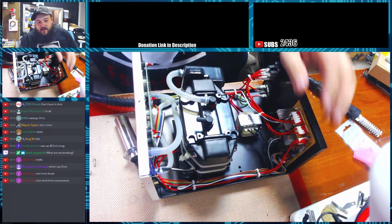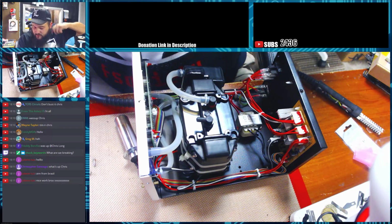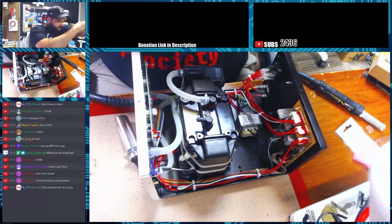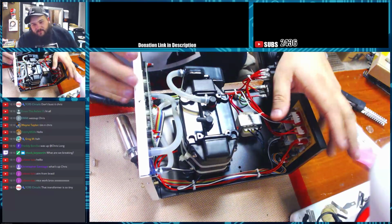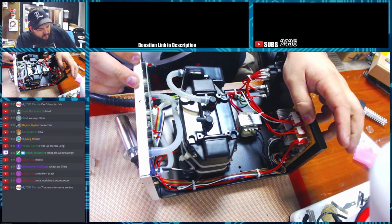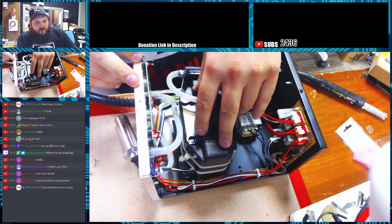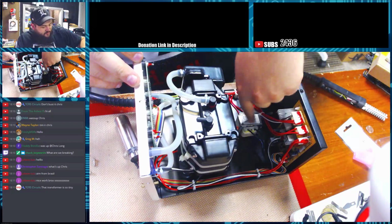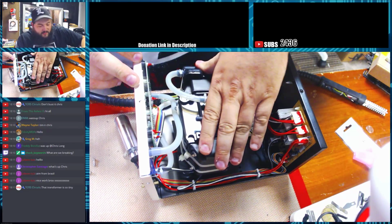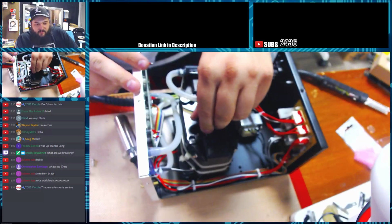Compare the caps and the internals to what Lewis had torn down on the quick station and Jessa had torn down on the quick station. These units are slightly different on the inside. They use a pump style unit versus a blower style unit. So yeah, it's got a small transformer. Honestly, I don't know why the transformer in the other one's so big, but it might be for the fan because the fan uses so much more power or something.